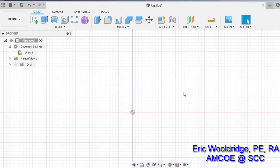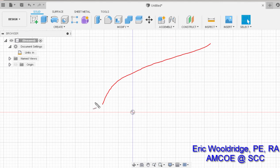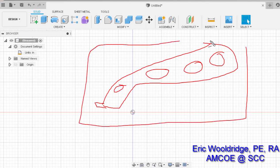Now the next thing we have to do is actually sketch. Just in case you're not familiar with the process, a lot of times we can take a plasma cutter and use it to cut out flat shapes. For example, if we're doing some kind of strut or support for an application, something that's 2D and has a lot of features, plasma cutters can take a sheet of metal and cut out this shape so the part falls out. It works off a 2D shape.